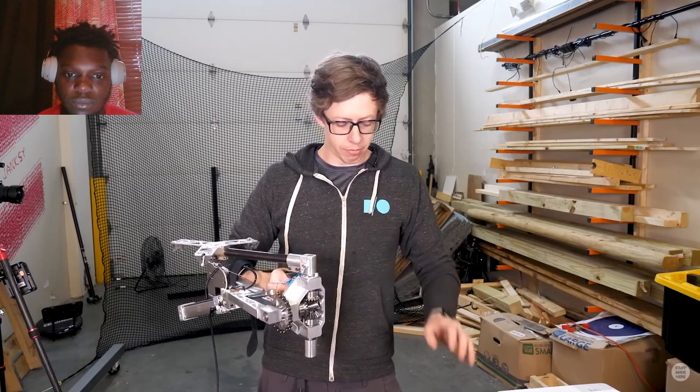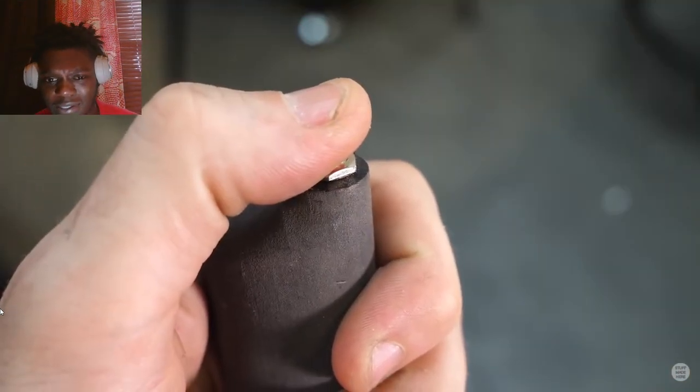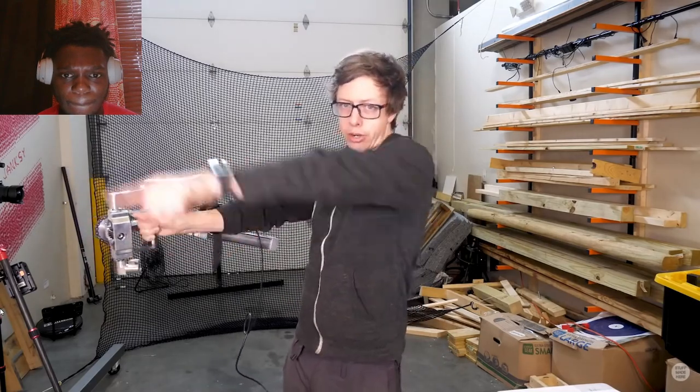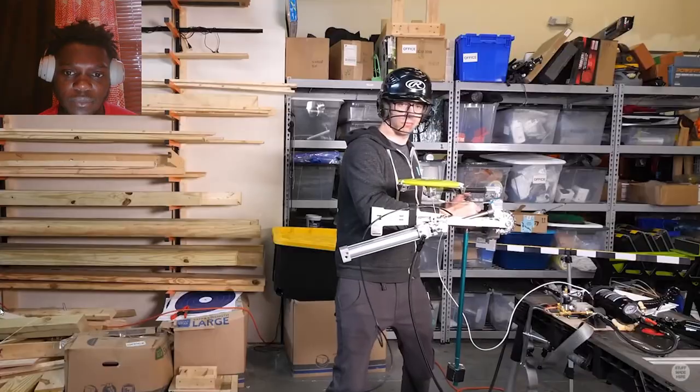So up until now, I've been using bench mode, which, if I hold the button for 2 seconds, it'll trigger it. But it also has throwing mode. There's an accelerometer and gyroscope on the launcher that monitors the tilt and rotation of it. When it reaches a certain point in the throwing motion, it will trigger it to fire the Frisbee. Time to just go for it.